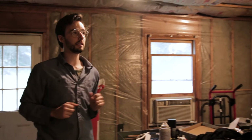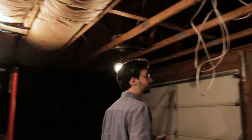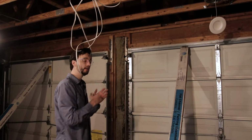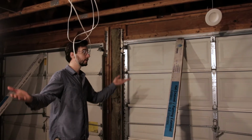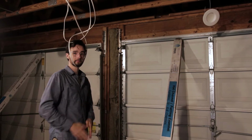So I've got our 6 recessed lights hung. These 5 are spaced evenly wall to wall. For our 6th light, it's spaced a little bit differently because we're planning on putting a bathroom here, which hasn't been framed in yet. If you're doing any extra framing after you hang your lights, you definitely want to make sure you get that spacing right so that everything looks even.